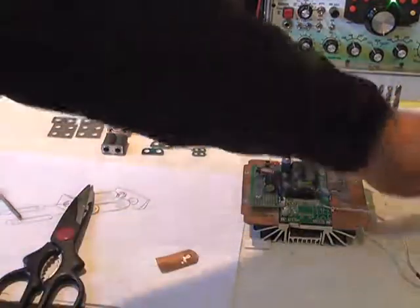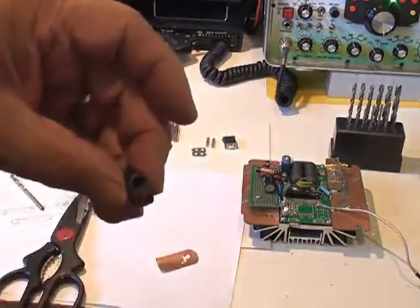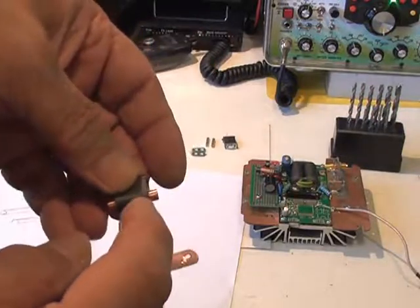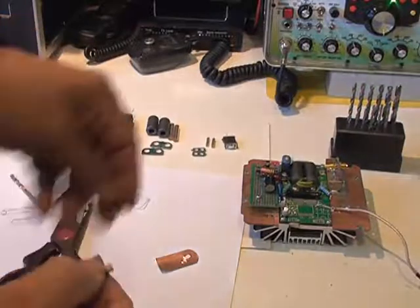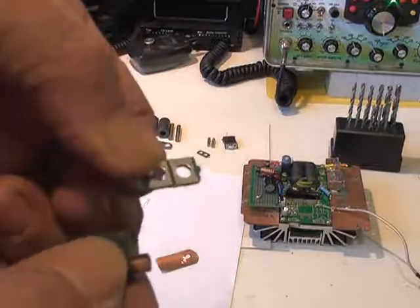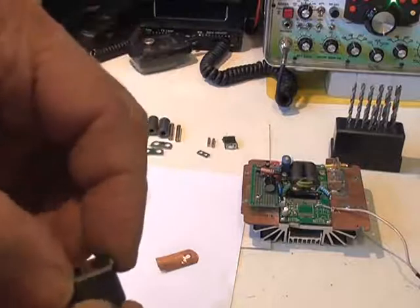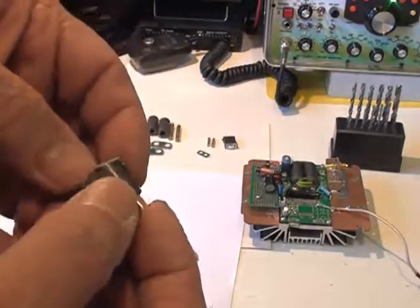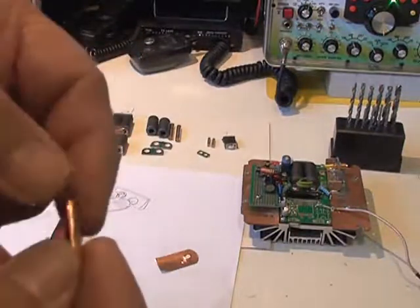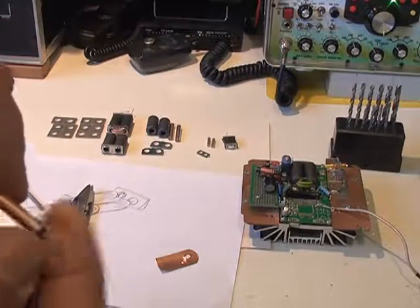This tube will fit inside the balun core just like that. It's a little bit longer, so I'm going to trim it so that it's long enough to enter and make sure it goes past the little tiny end pieces, which are going to fit over the core like that. It's going to protrude through that hole, and once I've trimmed it I'm going to solder this edge with a very fine line of solder.